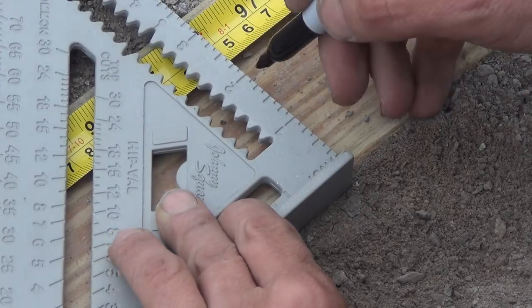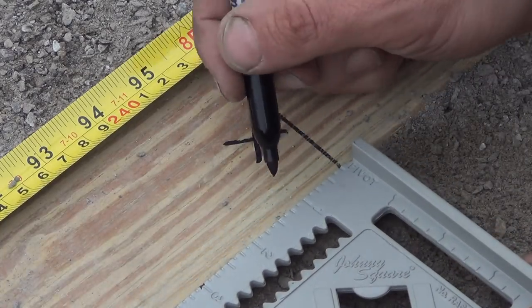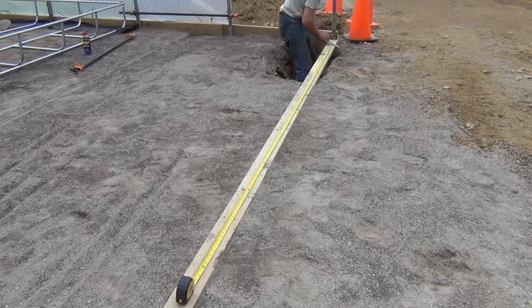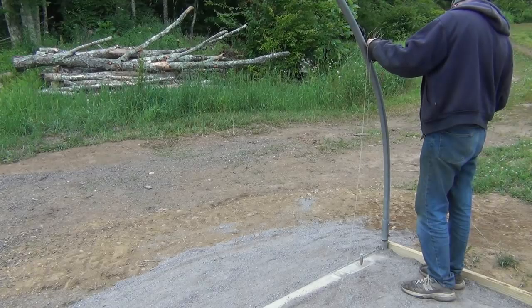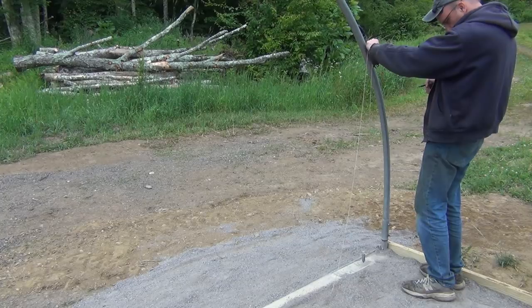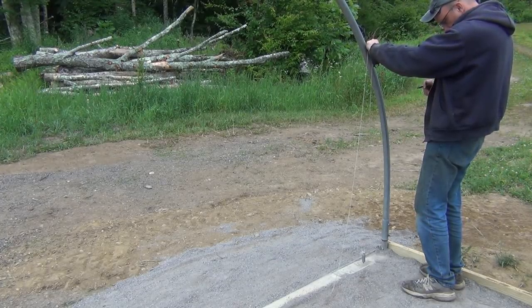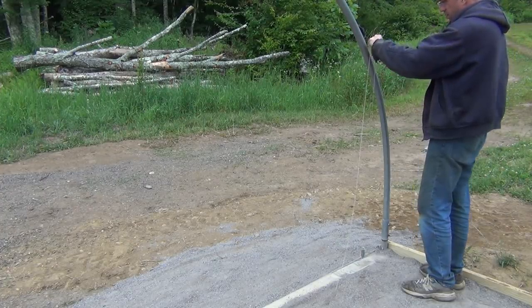Trying to get this done in a hurry. It looks like my electrical work is going to be done sometime next week, so they need a wall to hang the sub panel on. It's always exciting trying to get studs to match up to weird shapes, but the easiest way I've found is just to use a plumb bob. That will give you a nice straight connection, and then draw out a mark where it's going to intersect with that.